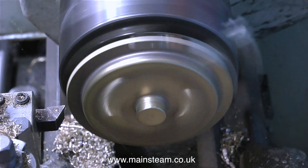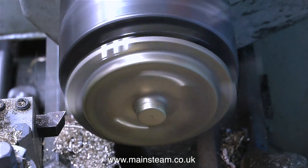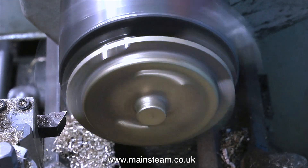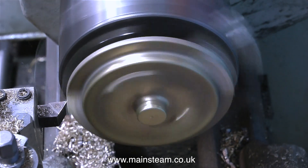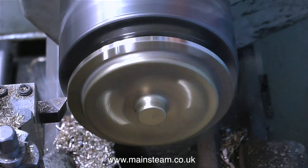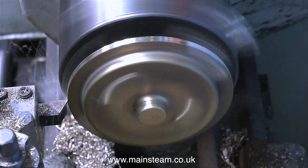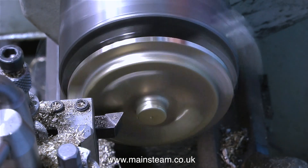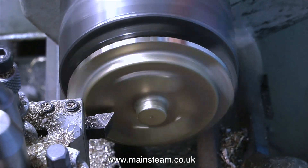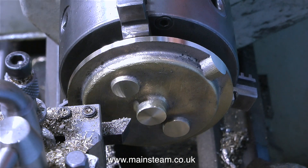The main function of this is to be a condenser oil trap. I want the steam to go up the chimney, but as the steam will be mixed with steam oil from the exhaust, I don't want the steam oil going up the chimney because otherwise it makes a sound like frying fish and chips. By having this condenser oil trap in the exhaust circuit, the mixture of condensate and oil can be drained off periodically, and what goes up the chimney is just water vapour, which will evaporate very quickly.